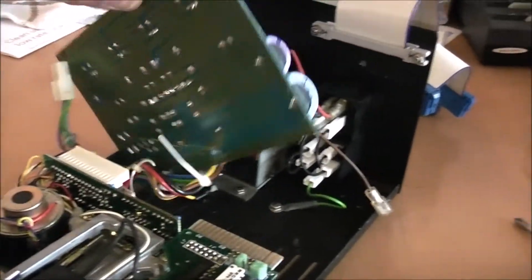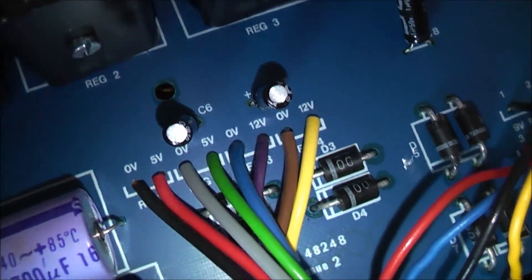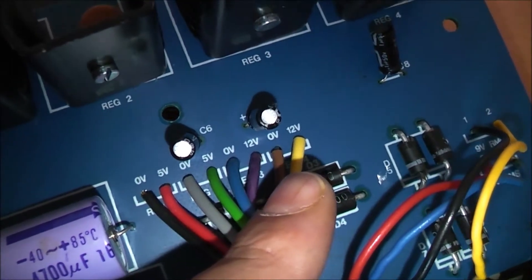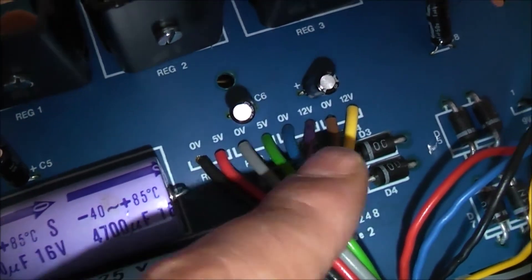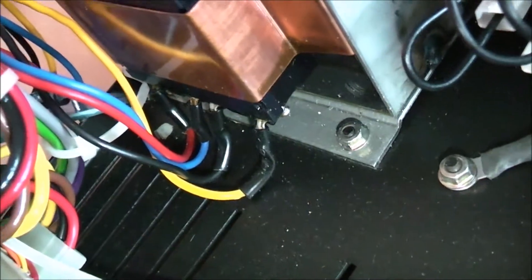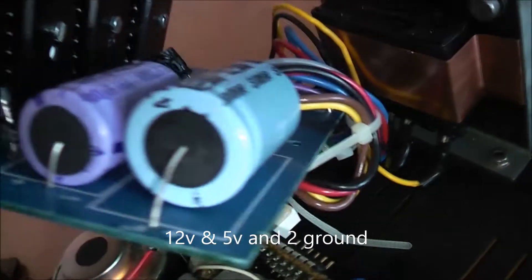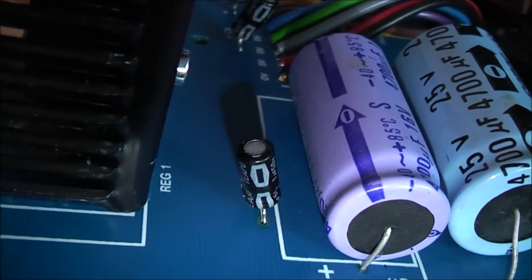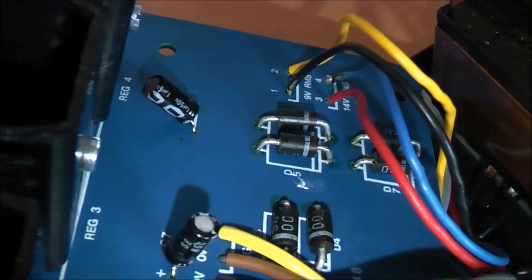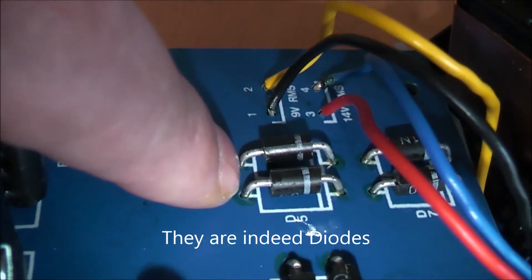So I have removed the circuit board and also removed the metal shield over the transformer. I was wrong about the voltages — it's actually just two 5 volts and two 12 volts. I thought one of them said 21 for some reason. So there are two 12 volts, two 5 volts, and the rest are 0 volts. On the bottom of the transformer we have four wires coming out — one or two will be ground and two will be 5 volt. I have these two huge capacitors here — one 25 volt, one 16 volt — a couple of smaller capacitors, all looking okay with no signs of leakage. And there are these heavy-duty components — diodes, transistors, resistors.